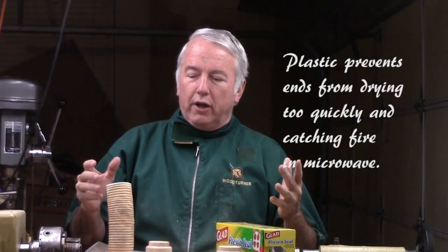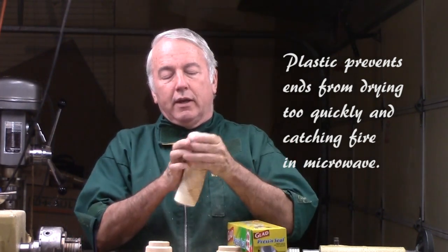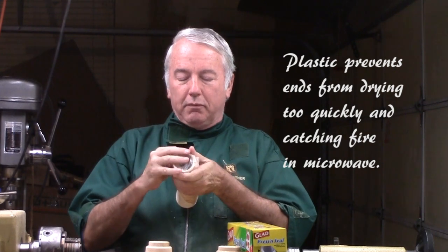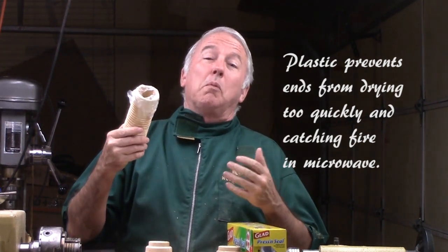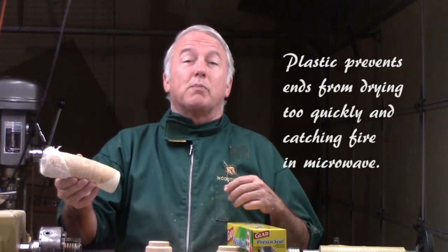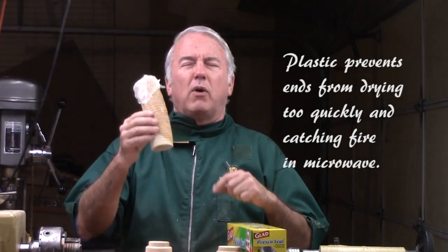Now with the turning done, I took the wood fresh from the lathe, put plastic wrap over the end of it, and poked a hole in the end to let the steam out, then bunched it up closer to the end so that the rest could dry. I think plastic packing tape would work much better. Put it in the microwave for a minute, pull it out, evaluate it, let it dry, put it back in the microwave for another minute on high, took it out, and it started to warp nicely, so I stopped. The problem with it getting too dry is that it then could catch fire, and my wife wouldn't like that in her kitchen.